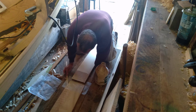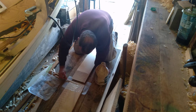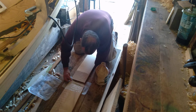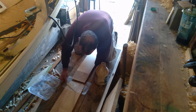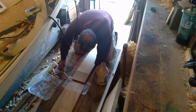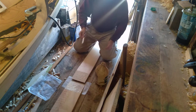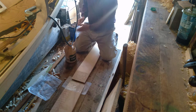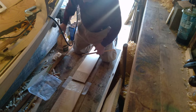There's a lot of nailing and whatnot that comes next in the process, and quite a bit of riveting as well, but no scarf joints. We'll be able to make use of some glues, like maybe we'll put some glue on the rails when we put them in, but there's no more scarf jointing. So that's the big one with the gluing: these scarf joints have got to be good. And I mean, they get riveted as well, but you just gotta take care to beware of frozen glues.